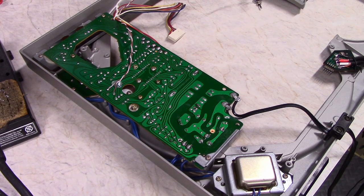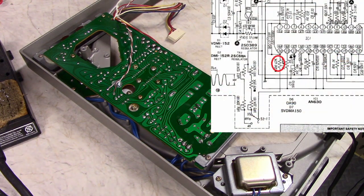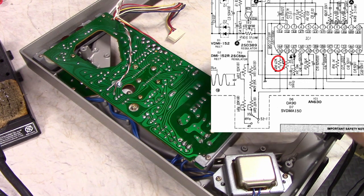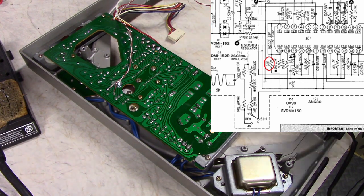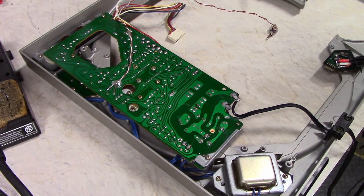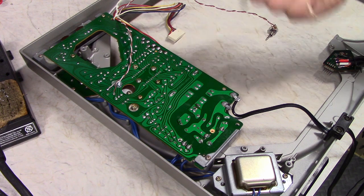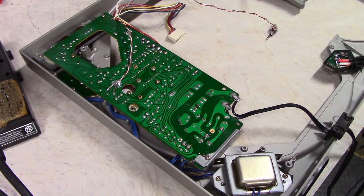I chose the path of least modification. This resistor right here that I've put my switch across is a 62K resistor — it's R10. When this switch closes it puts another 25K in parallel with that 62K, which gives me about 18K of resistance. So that gives me the 44K or so I need to take out of the circuit to give me 78 RPM. The caveat with this approach is that this resistor is in the chain for both 45 and 33 RPM. For this to work you need to have it set to 45 and then flip the switch to get 78. However, if you go back to 33 over here you'll get some weird speed in between — you have to make sure you flip this switch back off.